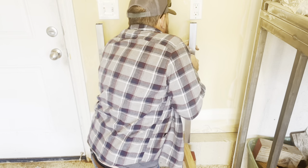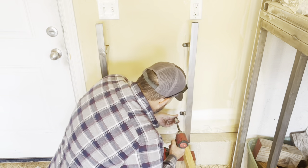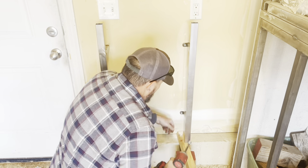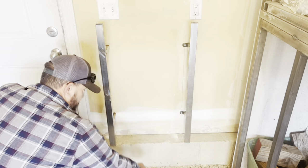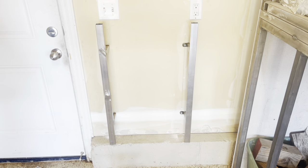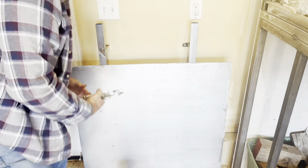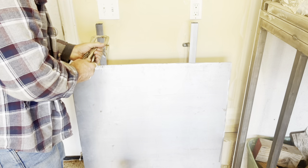That little concrete footing is four inches off the drywall, so I'm going a little bit more to allow that air to come up underneath and circulate around the heat shield. For the surface of the heat shield, I'm using sheet metal and you can use anything non-combustible: cement board, brick, tile, anything that won't burn.